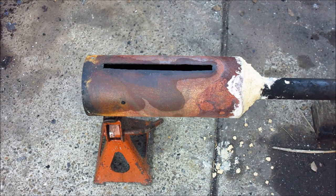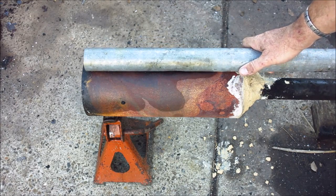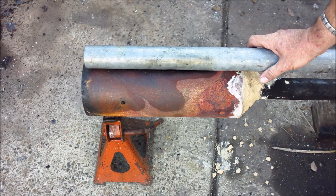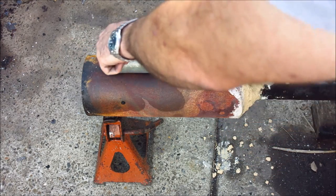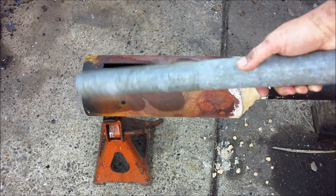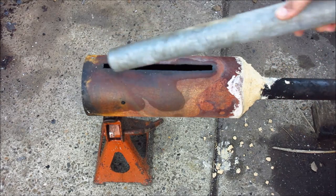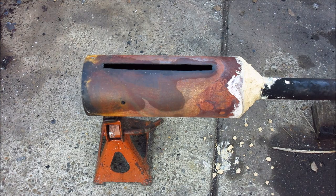The design of this burner is simply a piece of pipe. The inlet goes right up to the end and butts up against it. I notched out a small piece of the pipe, turned it over so it's on the bottom, so the air stream comes out, goes to the bottom, circulates around, and comes out this long wide slit.